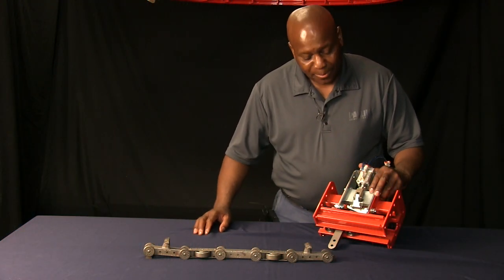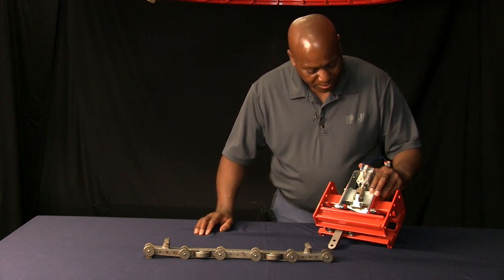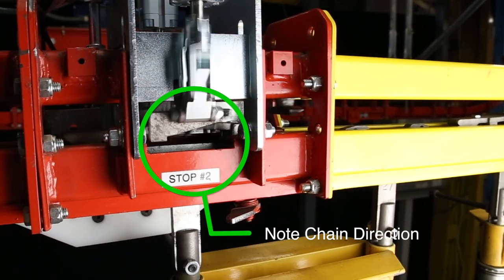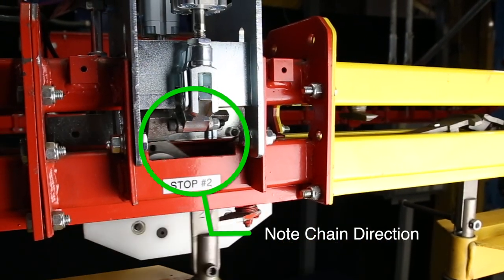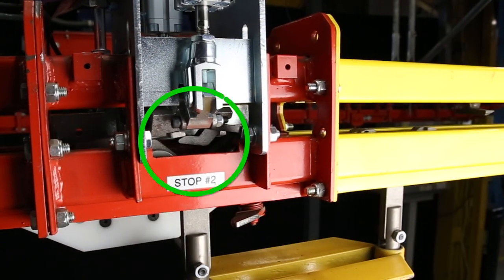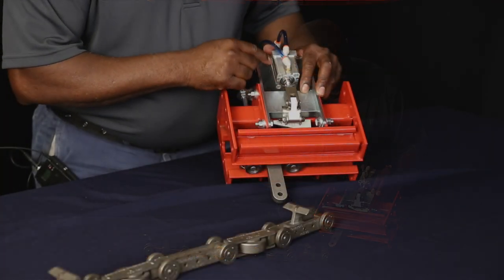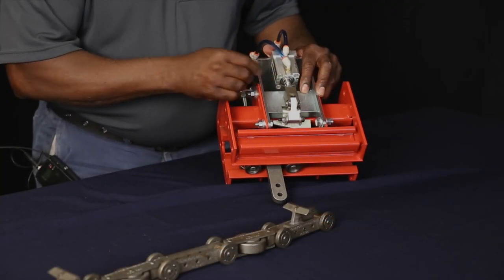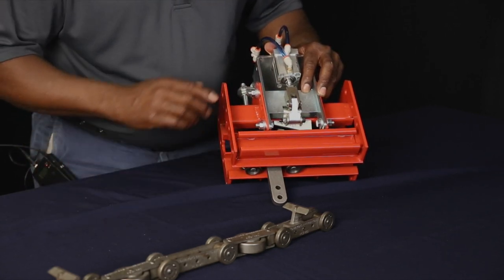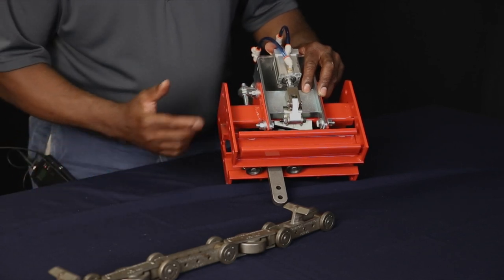This is one of the most integral parts of the power and free system — it's called the stop unit. It's an air-powered stop unit with a left and a right hand, so this one is actually a double-bladed stop. In recent days we've added an extra blade to facilitate alignment of the trolley stopping in a straight line. This adjustment here — the cylinder is adjusted with a dumpy cylinder with a little thread on the end — adjusts the movement in and out, which lines the flapper up with the dog as it passes through.